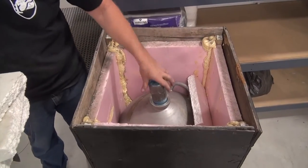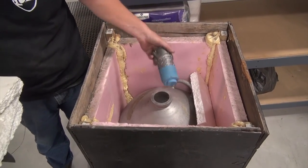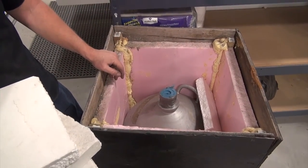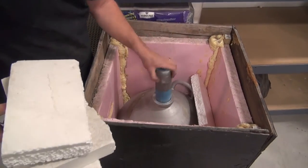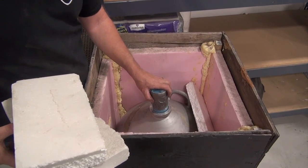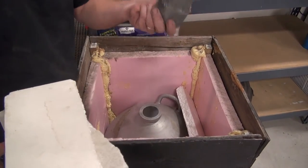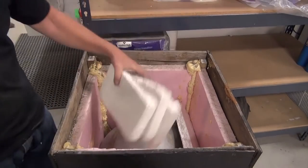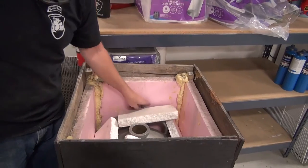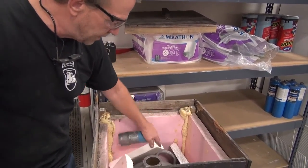And we buy liquid nitrogen 20 liters at a time. It's actually a 30 liter Dewar. They use them in agriculture for semen, different things like that. Got it on eBay for a couple hundred bucks. You can get liquid nitrogen from most welding gas supply places. Now, it didn't come with a cap, so I have a fancy foam thing. I built this insulated box. It looks hideous, but it works. It adds about 2 to 3 weeks of life when we get one of these tanks filled up.